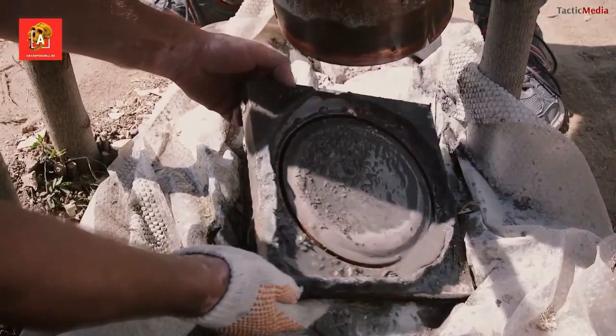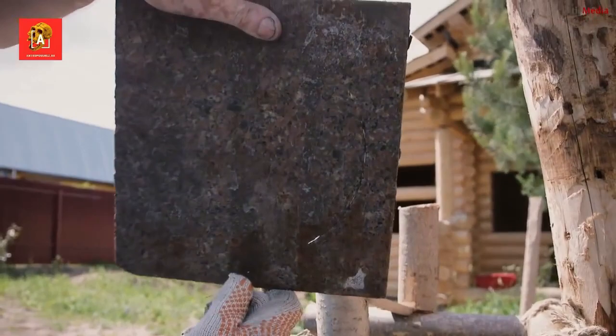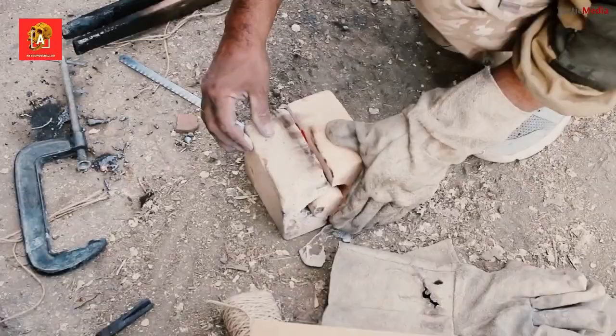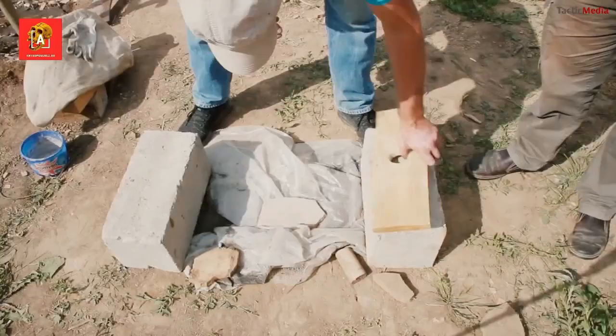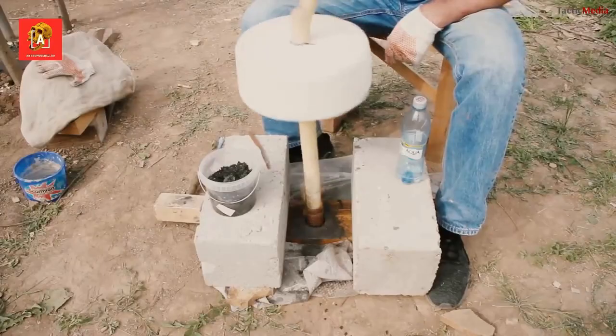We'll have another clip in a moment, because even though that tube is rather shallow, you can make tube holes as deep as you want. There's a very simple method for that. From that same video, they just made a cast, probably out of plaster, and poured some copper in, and you're left with a copper tube. Just break away the material in there, and there you have your very simple copper tube. So, two basic methods: either you wrap a copper sheet around the shaft, or you can cast a copper tube very easily.